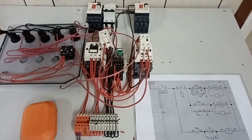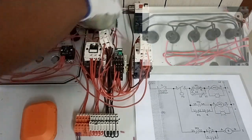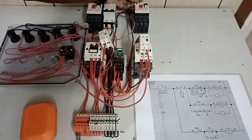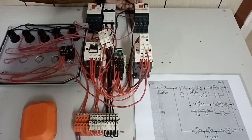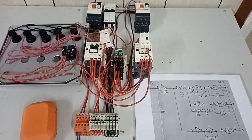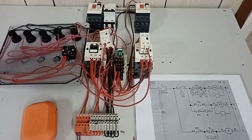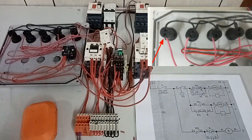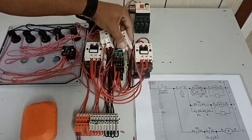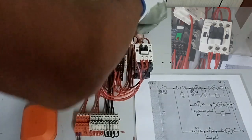Now for our trip indication light number 2 — the wire is placed, and it goes to the other thermal overload relay normally open contact. As I said, once it trips, contact will close and trip indication light number 2 will light up. Last but not least, the indication light for run number 2, for our M2 contactor. The wire goes to the A1 terminal of our M2 contactor. Remove the auxiliary contact block and place it at the bridging of A1 going to the normally open contact of M2 contactor.